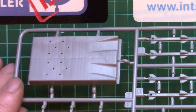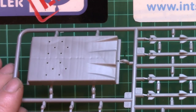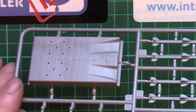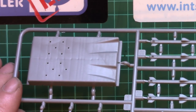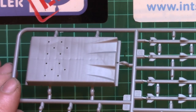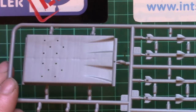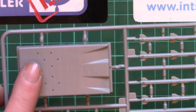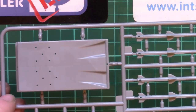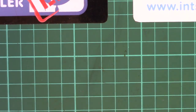I'll just angle it so you can see what a sink mark looks like - it's basically where the plastic is a bit thick and as it cools down it contracts a little in the mould. Someone more qualified in moulding techniques would be able to explain better, but if you get them on the surface they can be awkward to fill and sand out. These are on the inside though so they're fine.